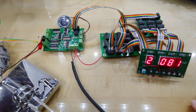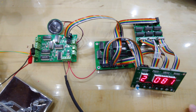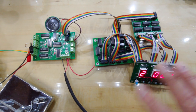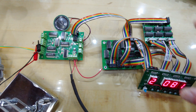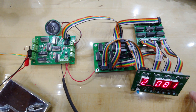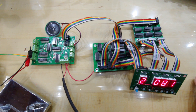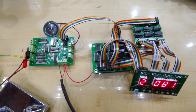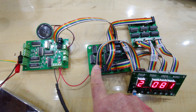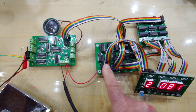So there you have it — a little bit of retro ham radio, and something to keep me busy. It's a lot of fun to convert these schematics and then make PC boards. In China now, these boards were about $10 for five, plus shipping — a little bit of nothing. These are a fairly complex board; it took me a couple days of work to get these 15 ICs laid out on a two-layer PC board.